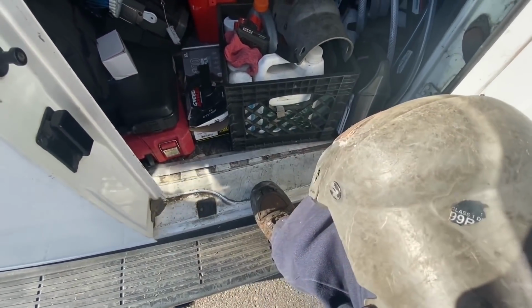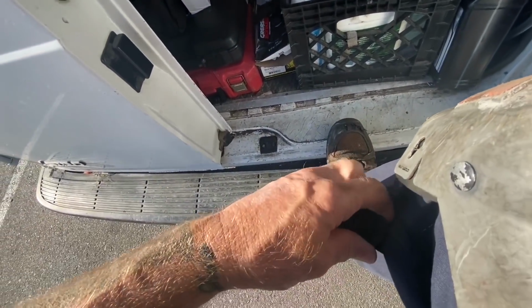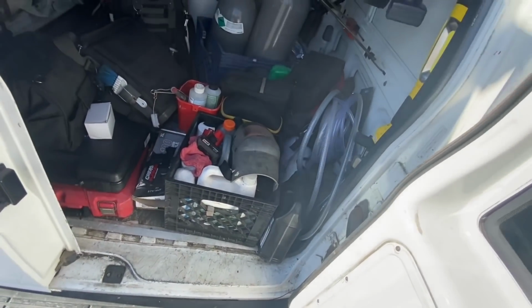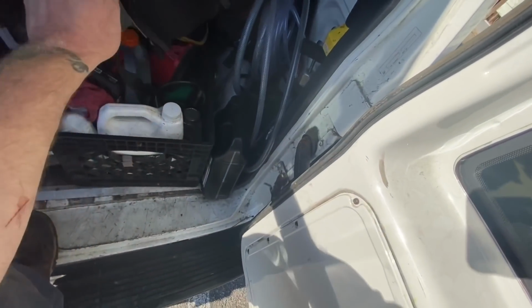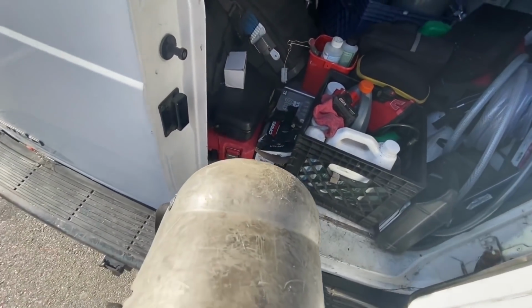So, went in there, and the evaporator fan was kind of stuck, and we bumped it and got it running. I saw the condenser's dirty, and we got to see if there's any gas in that thing. Clean that condenser for sure.